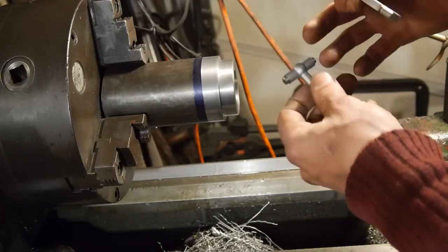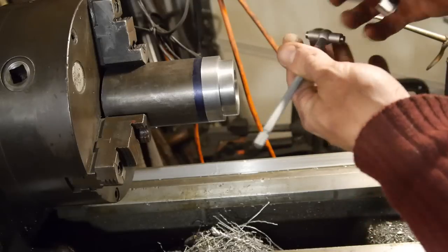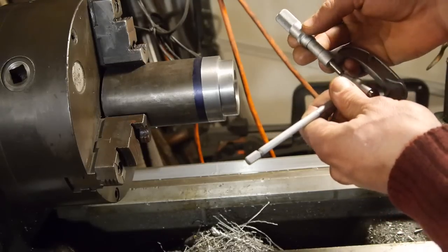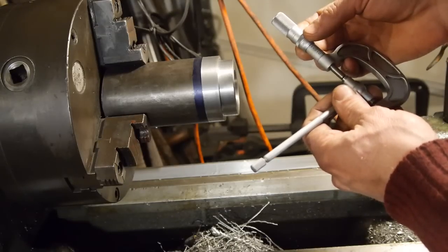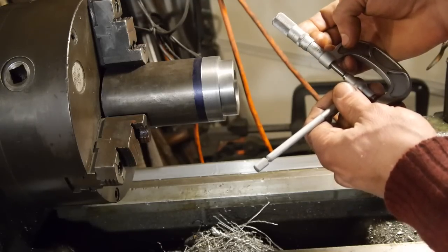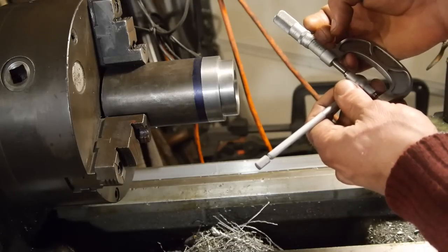These little pieces might tweak when you tighten it up. I'm used to a micrometer with a ratchet but this doesn't have one - Dead Man's Tools. Reading 1.4935. I'm just squeezing too hard. The bore gauge and micrometer always end up a hair bigger, but it's pretty consistent.